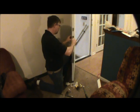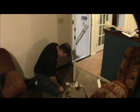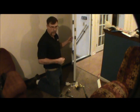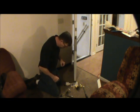And again, just snug them down, try not to over tighten them. Like I said, the softwood strips very easy on that. It's a good idea to hang on to the long screws just in case you do strip it out. The long ones really get a lot more bite to it if you need to, but as long as you don't over tighten, that's not a problem at all.